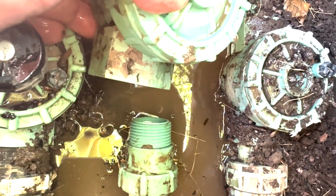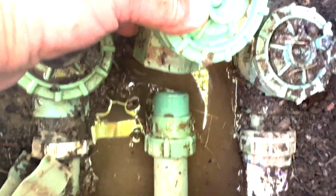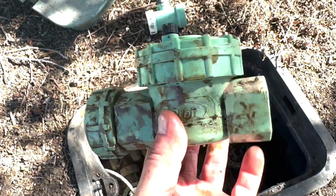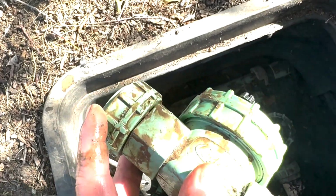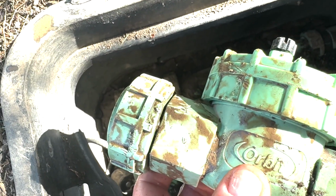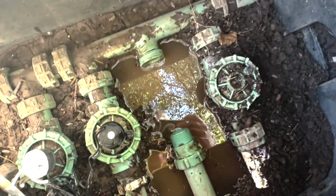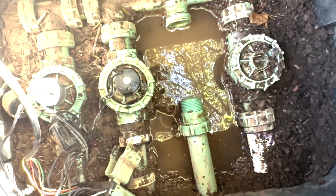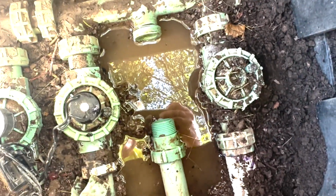Okay, so what's awesome is with my channel locks, I was actually able to just unscrew it. Once I popped that side off, I was able to raise it up just a little bit because that pipe is actually a little bit flexible, and I was able to get it off. So this is the valve, and this fitting here, which is the union, I'll be able to take that off and put that on a new valve that looks exactly the same. I'll clean this all up, and then we'll reinstall the new valve. And I can't believe it, I didn't have to cut that pipe, and I'm not gonna need any other pieces. Thank goodness for that union joint there. It allowed me to do all this.